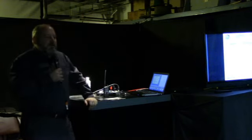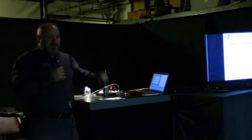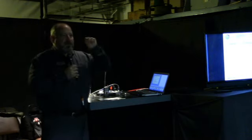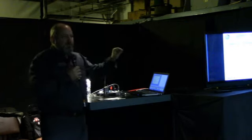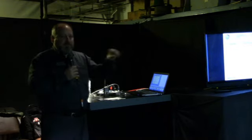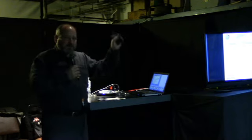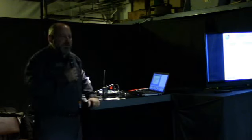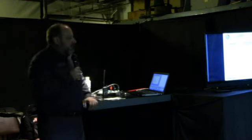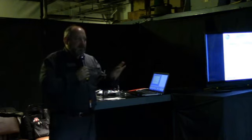The DSTAR calculator is a pretty cool feature. I kind of glossed over the routing a little bit because personally, I think if you spend any time using that DSTAR calculator, it's great. You can go in there and say, okay, I'm here in Cincinnati and I want to use this repeater in Cincinnati and talk to someone somewhere else, a repeater, reflector, whatever else. You can just pick them off lists. A lot of the functionality of these radios, I think, is patterned after that calculator. Then the calculator will show you the settings you need to put in your radio, and you'll see that right away. You can save that in a memory channel if you want, and then you can reproduce that at any time.